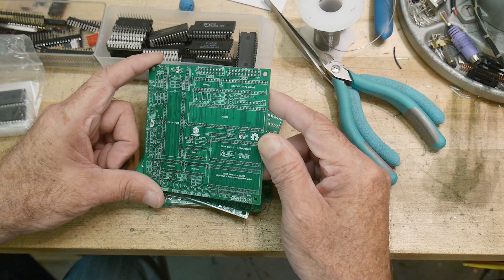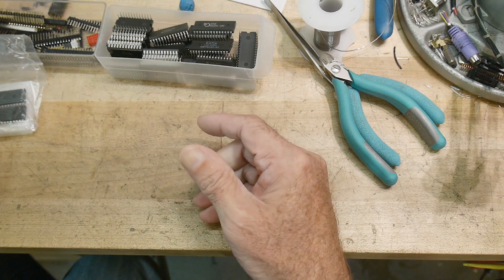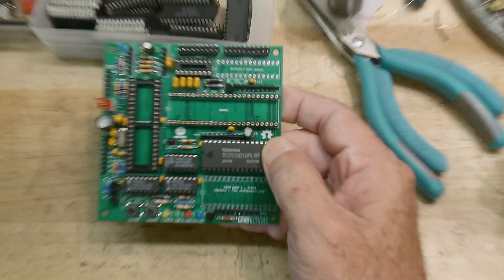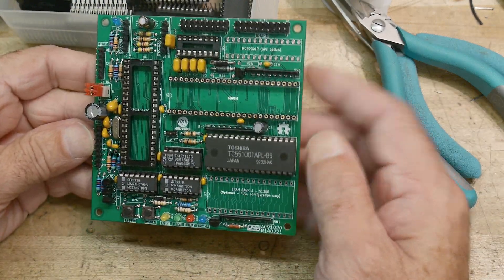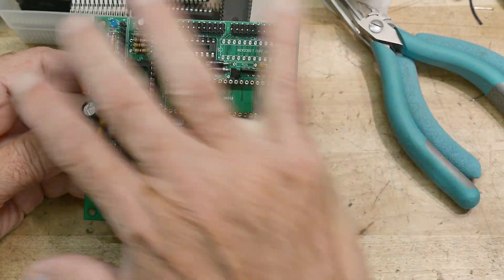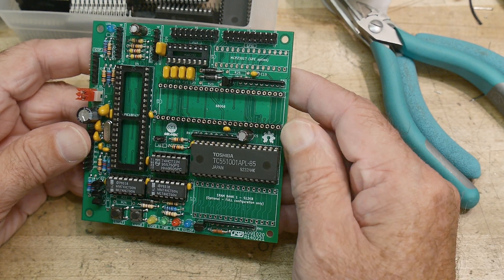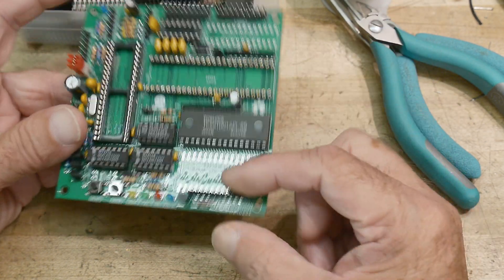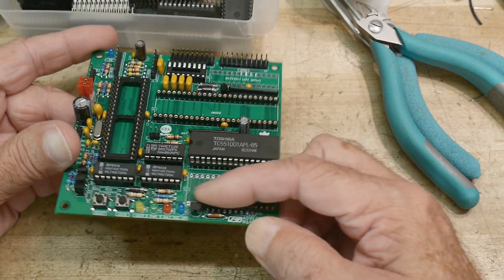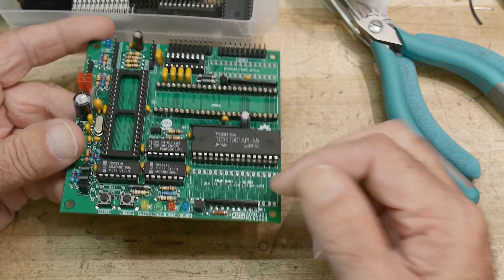I'll put a link below for you to go check it out. I did get some boards and didn't film it, but I've been having fun just off camera in the garage building it up. Most of these parts, almost all of them, I had in my junk bin, so I haven't had to buy anything — except I did have to buy resistor networks. I didn't have any 10K resistor networks that were long enough. I needed an 8-resistor SIP and these were 9-resistor SIPs, so I just snipped one leg off.